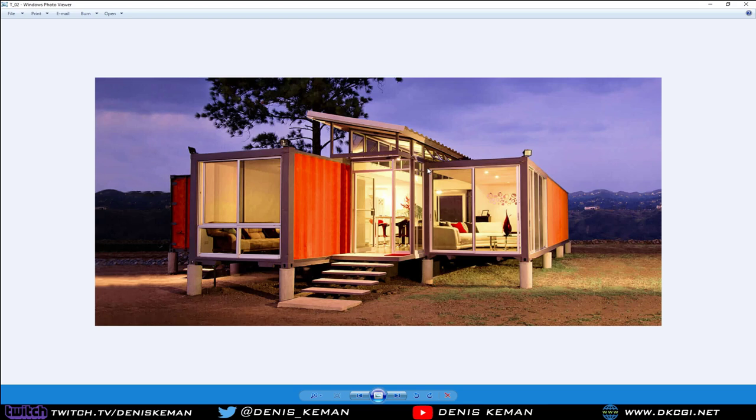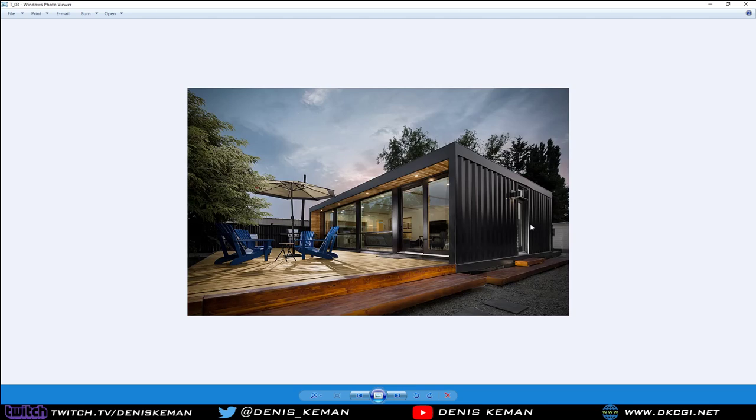They're placed up on the corner for all of those shipping containers, which means that even though this land can be not flat, since we've built up all of these poles and they're off from the ground, they can be made so they're all at the same level. So you're gonna have the whole house being leveled.